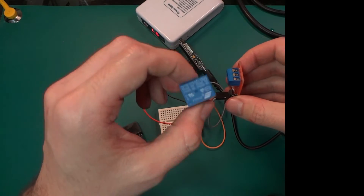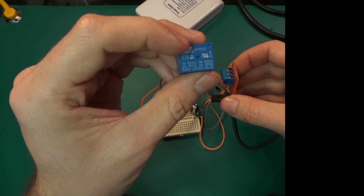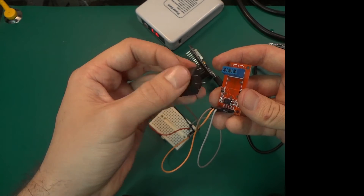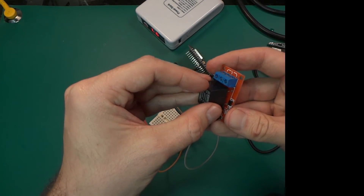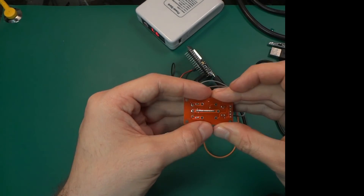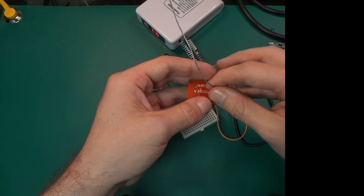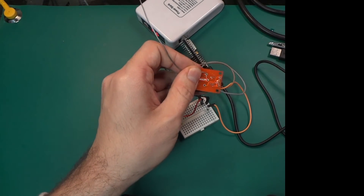I really spent quite a lot of time trying to find this. I didn't expect it — I was looking for a software failure, a hardware failure. I checked all the wiring, but it was the relay running on the wrong voltage.